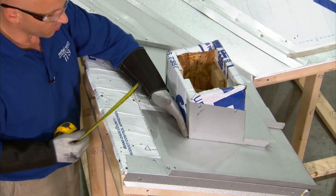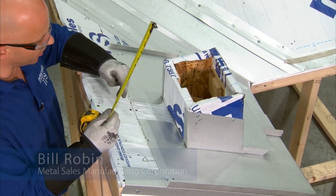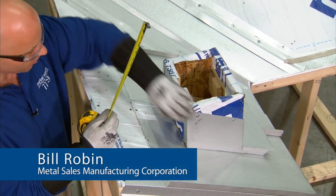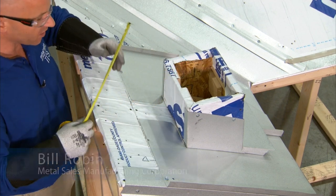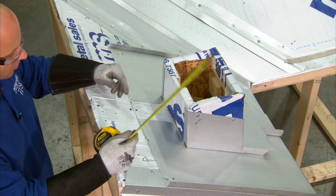From the back side of the penetration, you'll see that we have panels six inches above the top of the penetration. I have one inch tabs on the rake wall flashings coming around the top. At this point, if this was a large penetration, I would build a cricket and install a cricket.